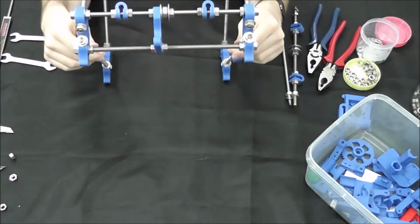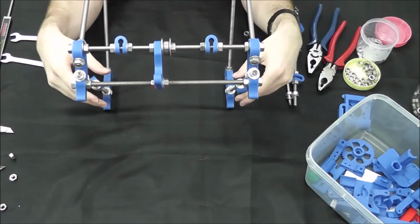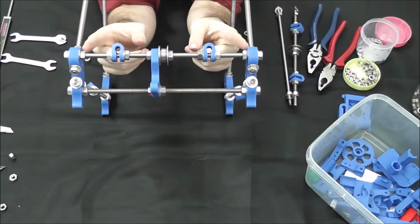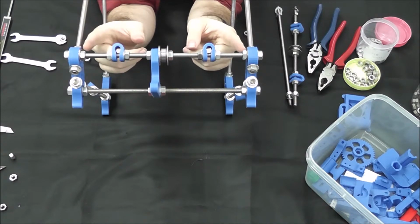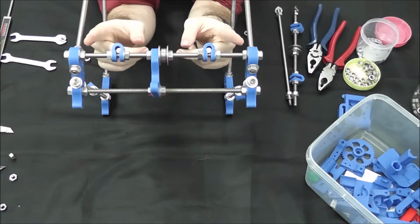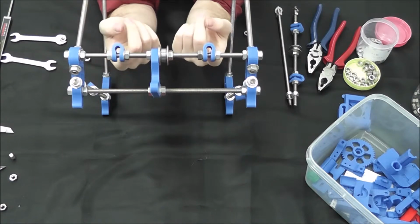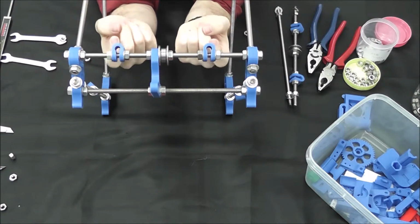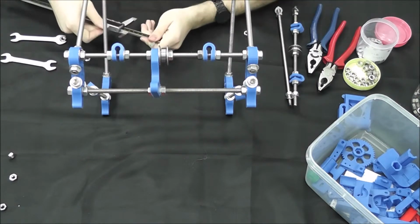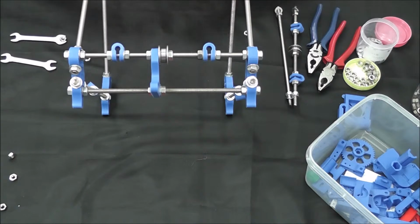What we need to do is make sure that the bearing is in the very, very center of the rod. And then we need to make sure that these two bar clamps are equal distance from the vertices. We're going to do that because despite how crooked your frame may be, the vertices will be stable. So the distance between these two will be fair, and it should be the same on the opposite side to ensure that the smooth rods that we're going to fit in are perfectly aligned. But first, make sure you have the bearing in the middle, and then you can choose whatever point you want for the alignment. We're going to use the vertices because, as I said, they're stable.